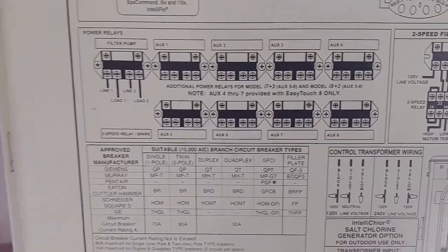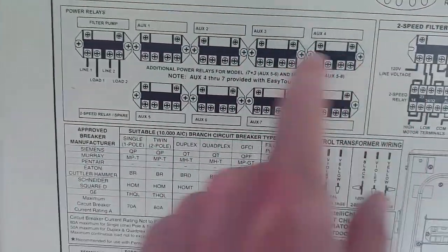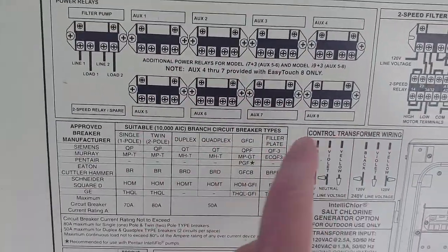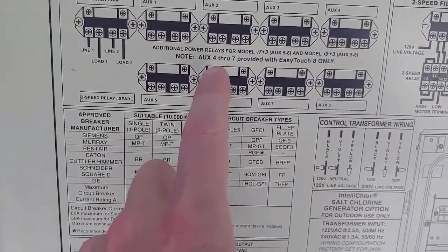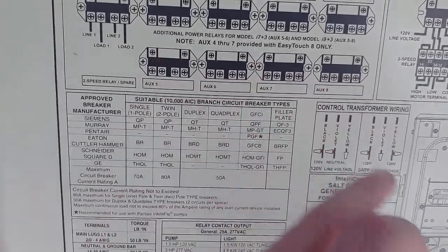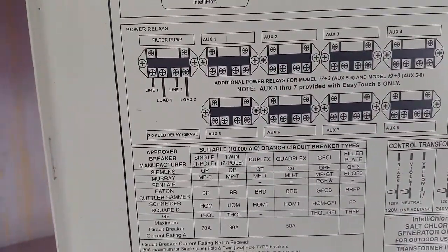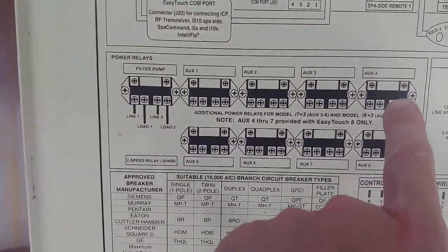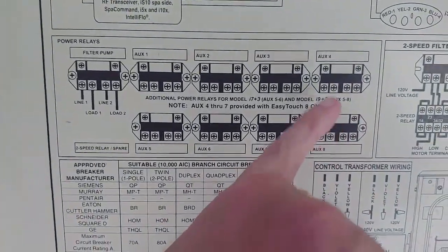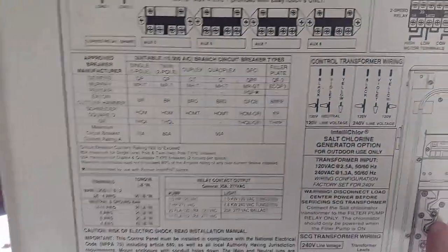Let's recap from your wiring diagram. Ultimately what's turning your lights on or off is one of your relays. I have the bigger system so I have all these relays, but you may only have one through four. I have all the way through seven relays, including a filter pump multi-stage — that's why I may have more relays than your panel. Regardless, you pick a relay and you have the power coming in from the breaker on the high voltage side.